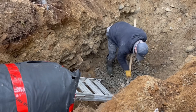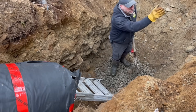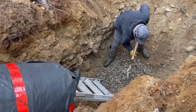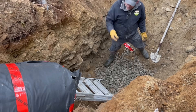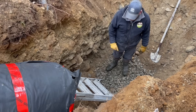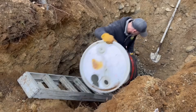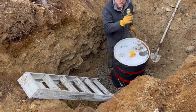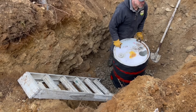I'm just going to level this out a little bit. The pipe comes here, so we're going to set it here and then dump that and slowly put gravel in. The key to this is to try not to squish the tank. I do have some plumbing stuff, I'm going to try to roughly plumb it so I know we're good. Now is the time to adjust if we're going to adjust.